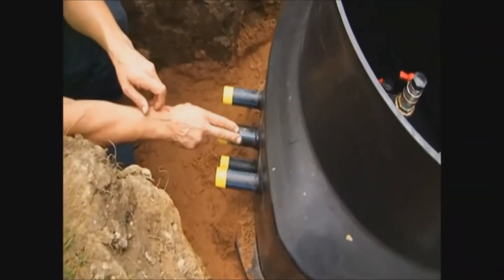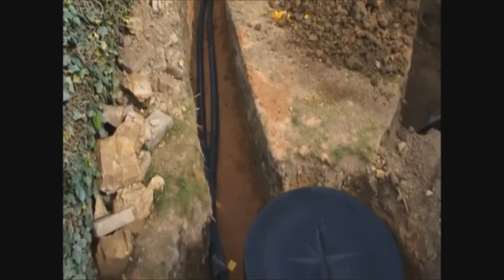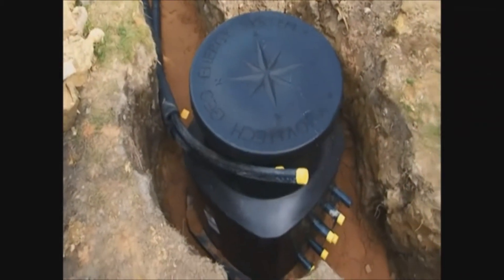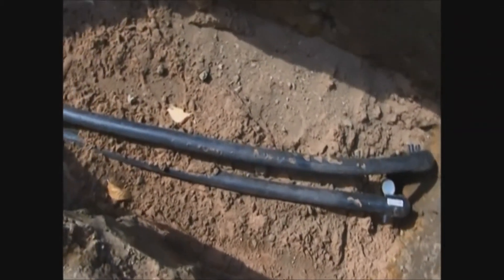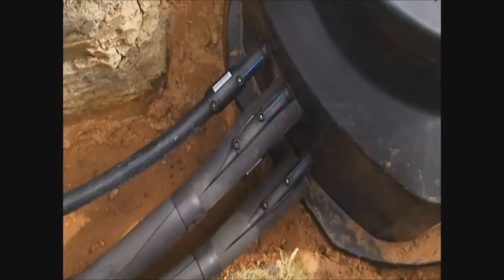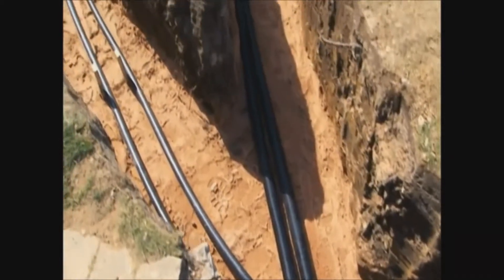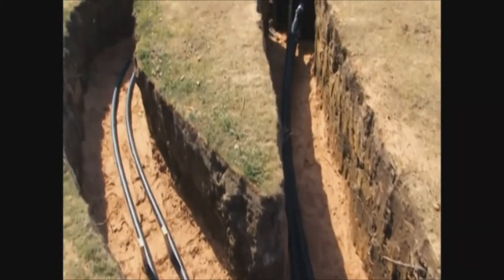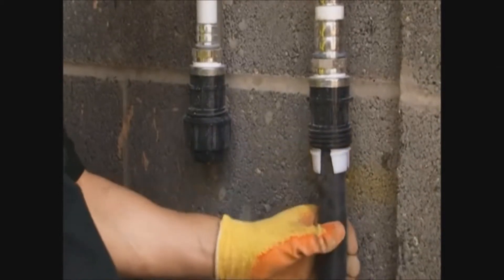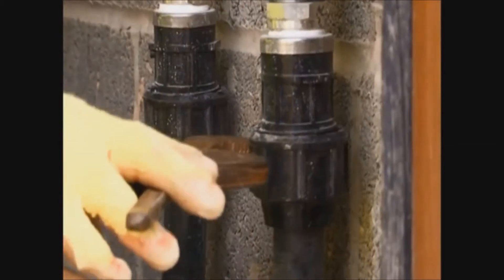Each one of these connections represents a flow and a return to each ground source loop. After the pipework is being laid out, we then fusion weld bends to the top of the loops and lay them across to the actual manifold, which then goes back from the manifold into the property itself with as little bends as possible, because what we are trying to do is obtain an equal flow into the manifold and back out again to the main pipework that enters the property into the heat pump itself. The last thing to do before we backfill the trenches is to connect into the main flow and return to the heat pump within the building.